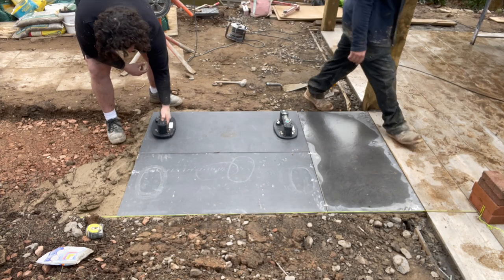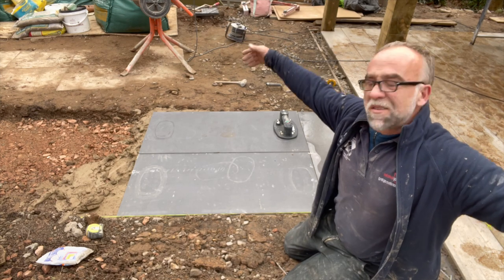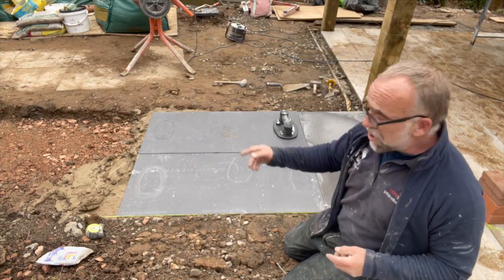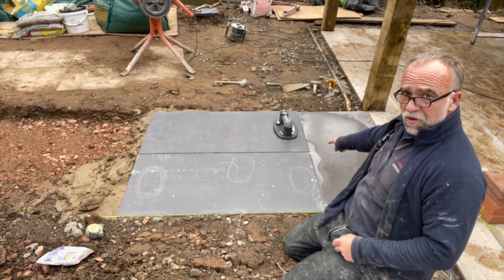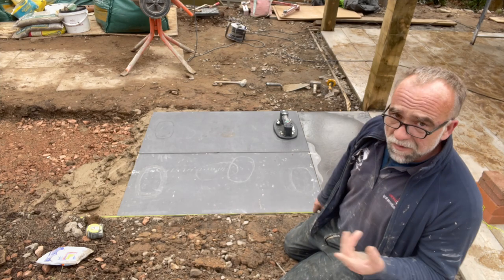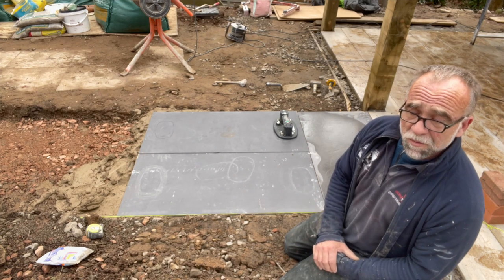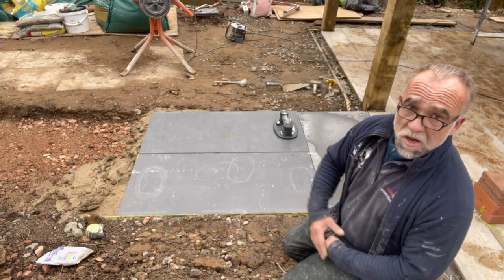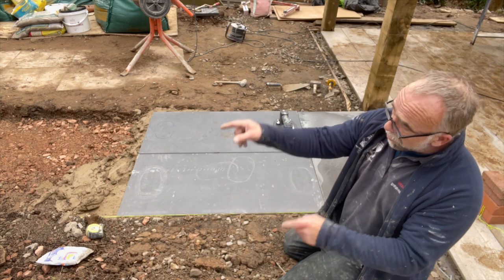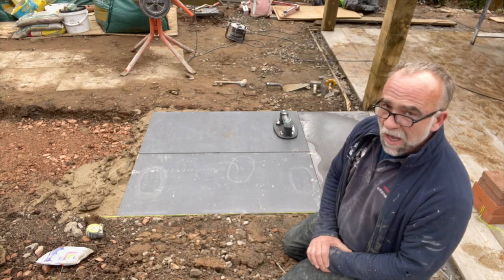Now I know the tile will fit. On top I've done a wiggly swerve along the top just to make it slightly rigid so when the tile goes on it sinks down to exactly the same height. I'm so glad I've got Grabos because this would have been really tricky. See how easy this is with two Grabos — brilliant. Imagine how hard it would have been with one person each end, getting your fingers into that corner, covering them in crap. Yeah, great example of why Grabos are good. Now tap it down, lay more cement, stick another one in.